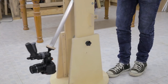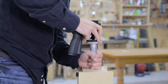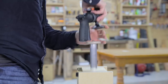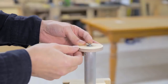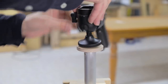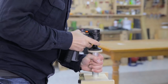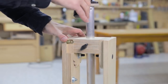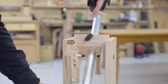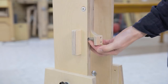Afterwards, all I have to do is flip the footage in a video editor. In order to be able to quickly attach and detach the pistol grip ball head, I've used a one-fourth to three-eighths of an inch screw adapter. I've screwed it in and glued it to a couple of pieces of plywood with epoxy, which in turn are then glued and screwed to the aluminum pipe. I've also attached a metal bracket to act as a stop for when I set the head back to its initial position, and I've used a recoil spring for the tilt lock.